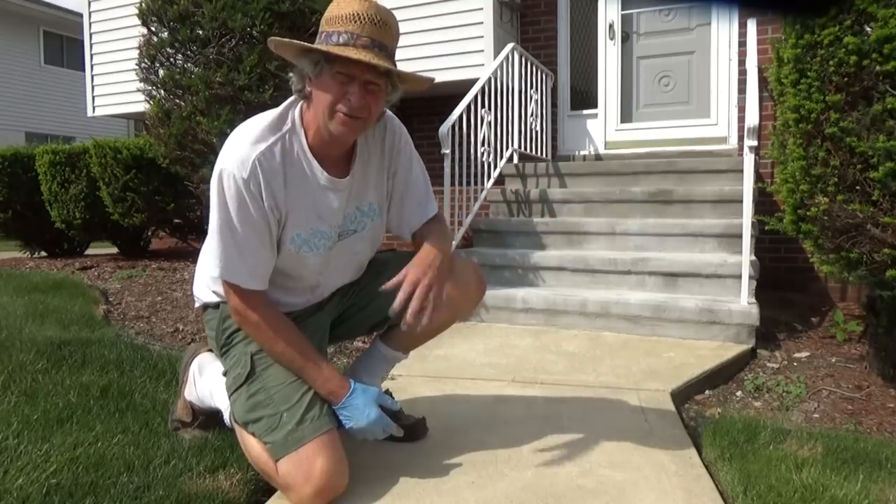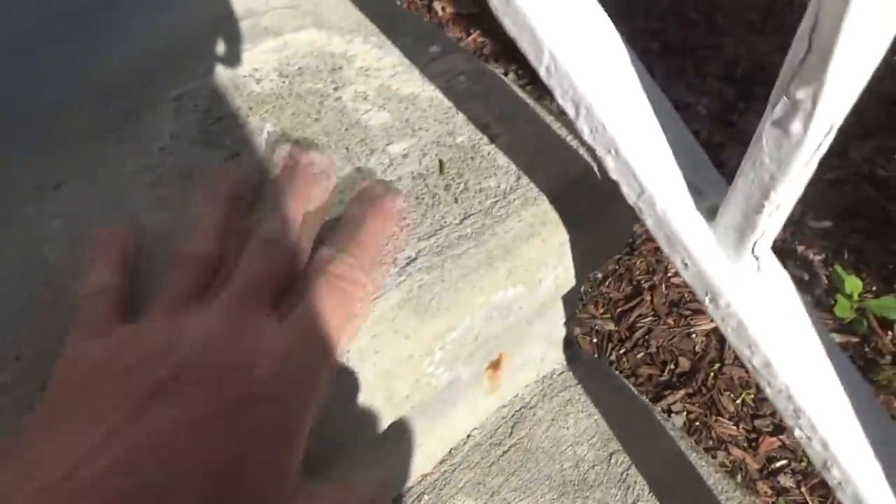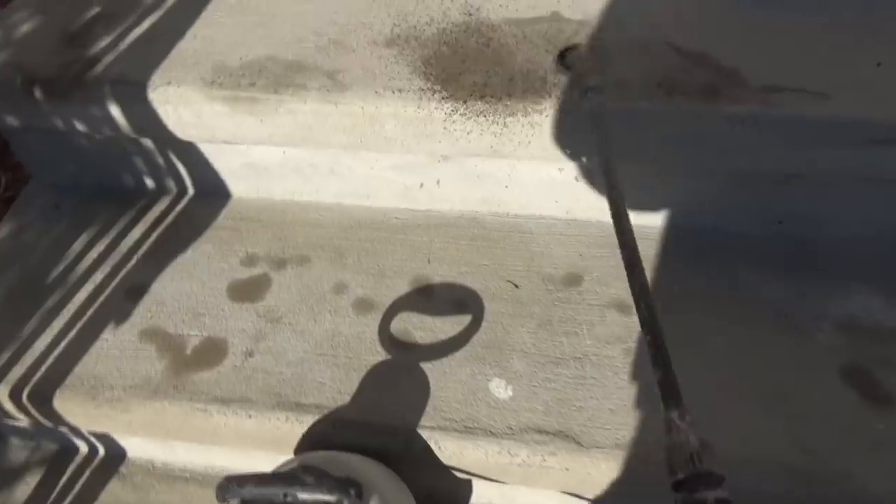This next video is another set of steps. I'm patching it with cement trowel and then I just paint it with Portland. Today I just patched up a set of concrete steps and painted them with Portland. We have a little patch-up fix-up job here. You can see these little spots - like this one, this one, underneath and here. What we're going to do is patch these up first, mix a little rapid set, and then paint it with Portland. So I've got my little sprayer with water - I'm just going to spray everything I'm going to do and let that sink in. Then I'm going to mix my rapid set.